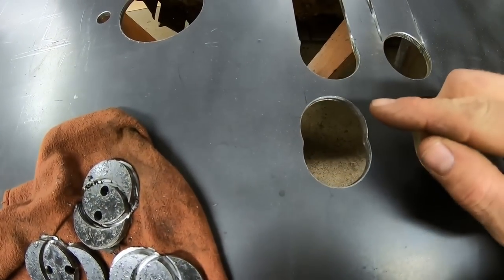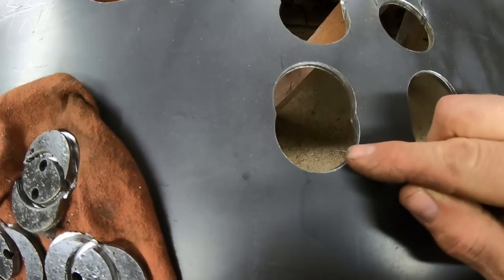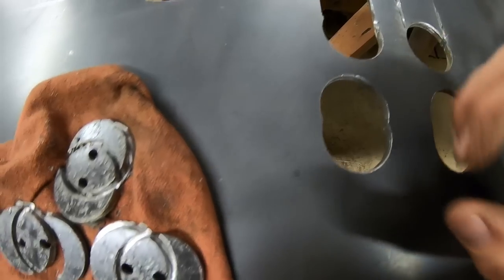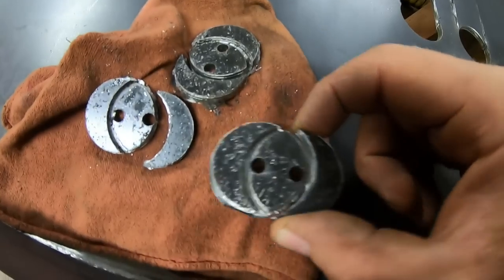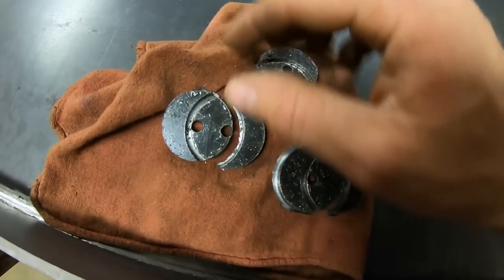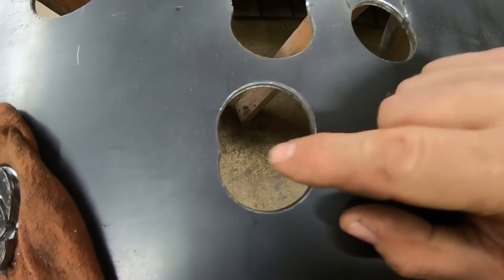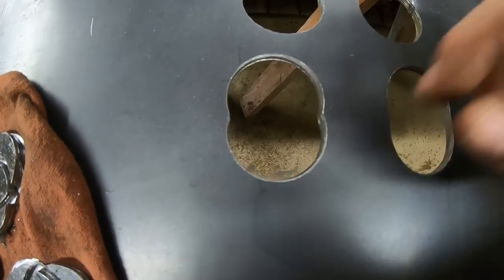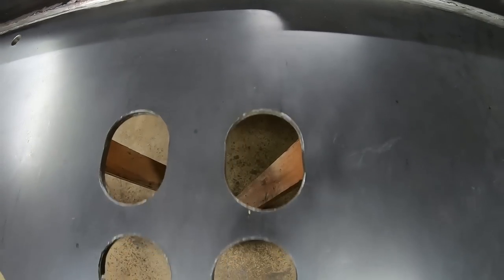And if you work the hole saw down incrementally, just cut a little on one, cut a little on the other, get them both pretty much to the bottom. By the time you can rip one of them out, it pretty much takes the other one with it. Sometimes you have to go back and crack off the other half moon shaped piece, but that works pretty well for those. And then I just go back with a file, just takes a couple minutes, just kind of flatten those nubs, and you're left with a perfectly oval slot.